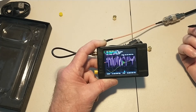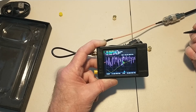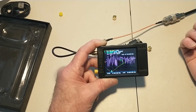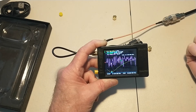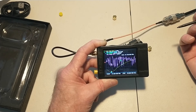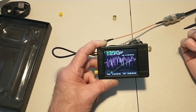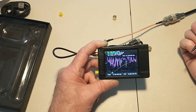Obviously this beam is still cut a little too long for the middle of the 10-meter band. That's useful — I can trim it a little bit and get it better. Let's see where the resonance is on this antenna. It's resonant at 27.740 MHz, so I definitely need to trim the driven element of this beam a little bit to get it centered up. I should put it right on the calling frequency. That's something I can do pretty easily — just take one screw out, slide the aluminum tubing in equally on both sides, drill a couple of holes, and stick the screws back in.